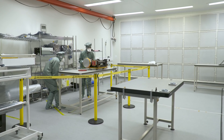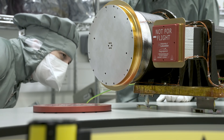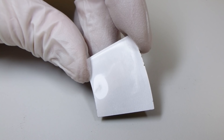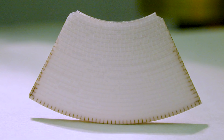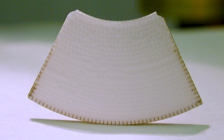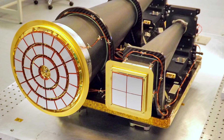MIX has a really state-of-the-art optic that's been developed here at the University of Leicester, which focuses light down onto a detector provided by our German collaborators. The optics on MIX are made from glass but they are iridium coated, which is a high-Z metal — we use iridium because otherwise x-rays can't be focused. The optics also have an aluminium film on the front to stop any stray light coming down the telescope, because that would wash out the CCDs and mean that we couldn't see anything from the x-rays.